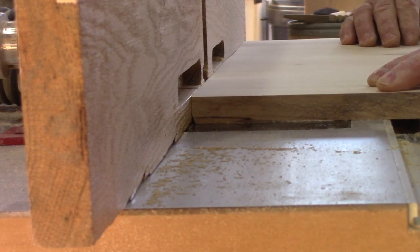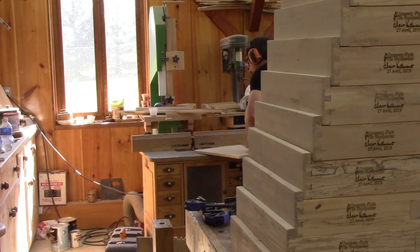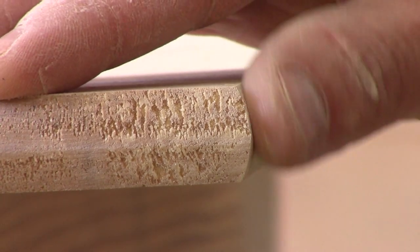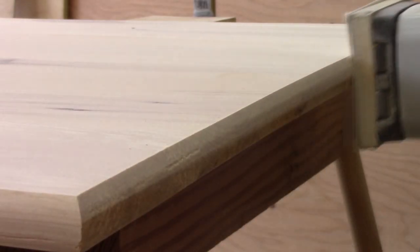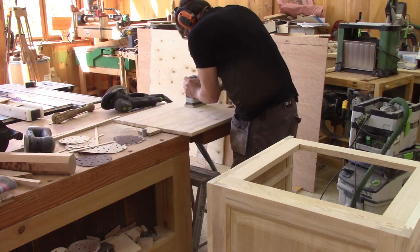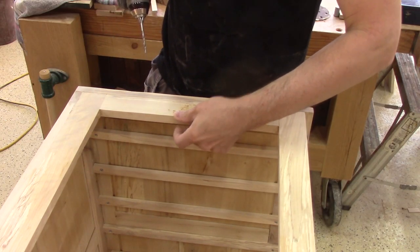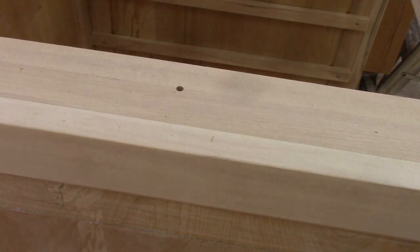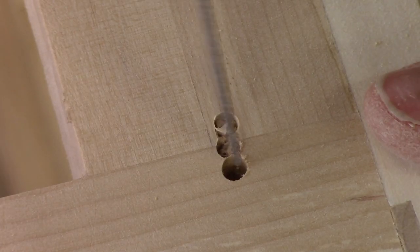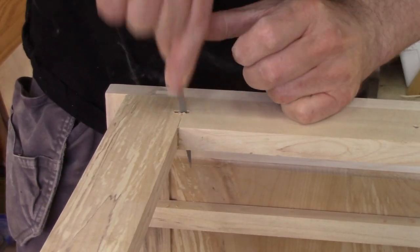In fact, I only use the top part of the bit. Here's the final result — it's exactly what I was aiming for. It's now time for the final sanding. This will be screwed just here. But to screw it in place, I need some holes in the top frame. I begin with one hole on each side in the center, but all the others will be elongated holes. I make them by drilling three holes and with a rasp, remove the wood between them. In all, I drill six elongated holes.